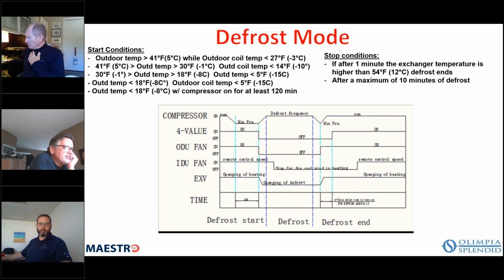Ryan had a question. What is the unit using to switch to a DC inverter voltage? Well, there is an inverter board on the unit, and the inverter voltage ranges from about 210 volts DC to about 380 volts DC. And in the installation instructions, in the troubleshooting guide, one of the faults is improper inverter voltage. The action there is to measure the voltage, which is DC plus and DC minus, on the IPM board, and that lets you know if you're outputting the correct values. Typically, under operating conditions, when the unit is running, it will be between 210 volts DC and 380 volts DC. Other questions?